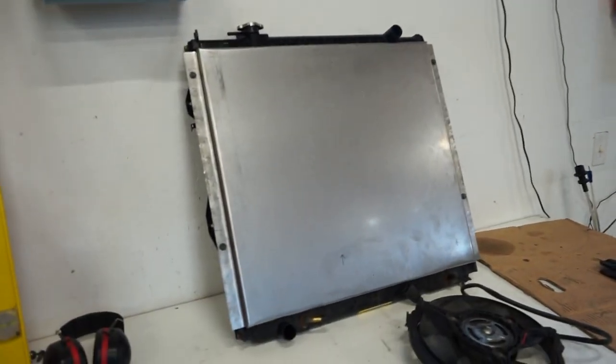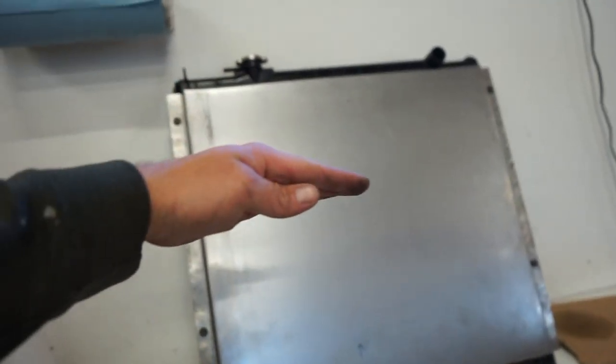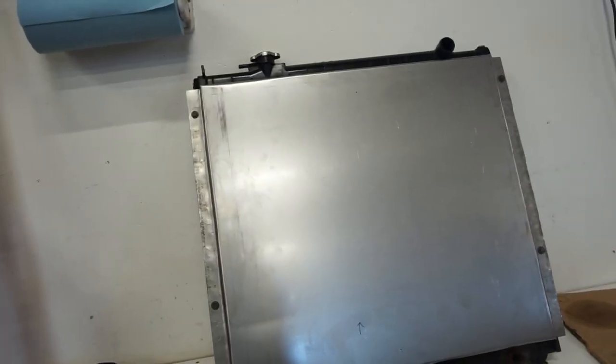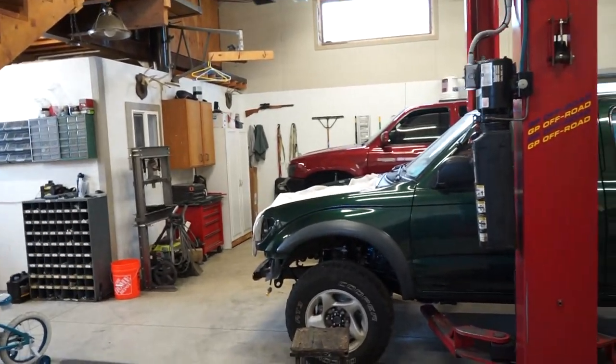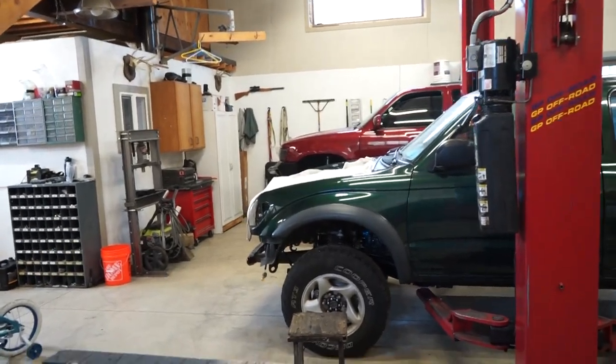And you're gonna have to be careful. Make sure your hole is a little bit bigger than the actual fan, because the motor does move and you don't want the fan smacking against the shroud. So I'm probably gonna give it, I don't know, a half inch, maybe 3/4 inch. These mounts actually, they're a hydraulic mount, so they're not super, super stiff. So the motor does move a bit. So I'm gonna give it a little extra room.